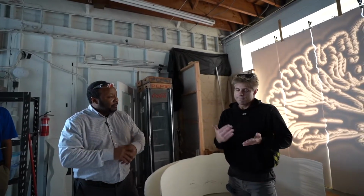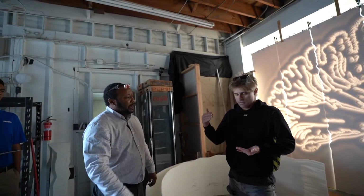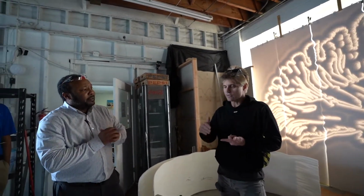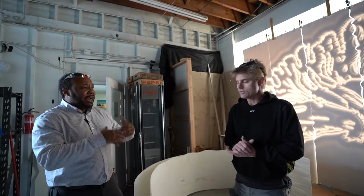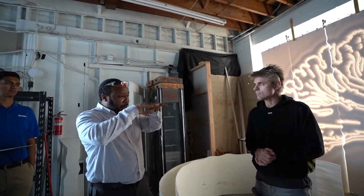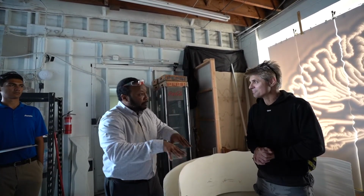Got it. So immediately, pretty much 5 minutes, you get 50%. In 20 minutes, you get 50%. So I'll recap. In 20 minutes, you get 50% of the strength. 24 hours, 90%, and then in 72, full cure is what we call it. And it's not really curing. What it is, on a microscopic level, if you look on a microscope, the VHB actually flows like a liquid. It's getting into all the nooks and crannies of your substrate.